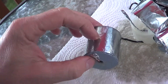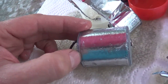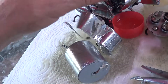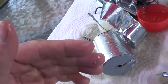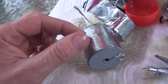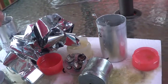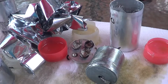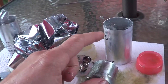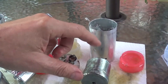So same thing here — they roll it up, then they stick it in molten metal and the metal sticks to one side which has a gap. There are two layers — basically two long sheets with one conductor on each side. I can't see anything mounting this thing differently. They're just going to go bad. Power spikes are probably the main culprit. And it was unusual that both of these were bad on the same capacitor, so maybe the same power spike got them both.